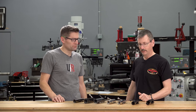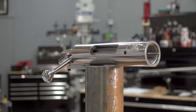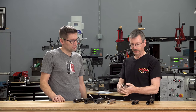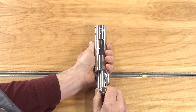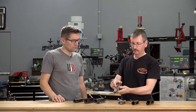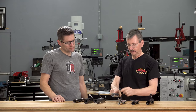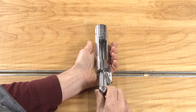Then we move to the three lug — it's a three locking lug bolt, 60-degree bolt lift. Available option-wise with all the same options I mentioned for the B. Here's another version of it in a multi-flat — it's multiple flats, 45-degree on the bottom for superior bedding. I really like this for bedding; it kind of forms a wedge action. Locks it in, very positive.